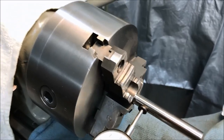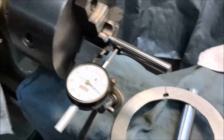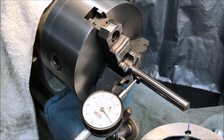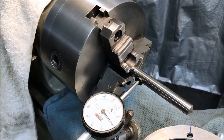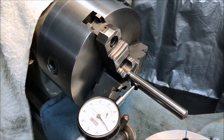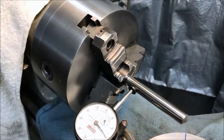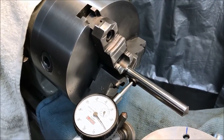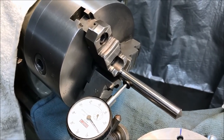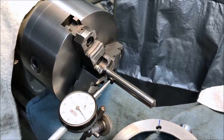Yeah, I did have originally this ring. I had the holes even smaller and it had less floating capability, and about halfway through the grind process I took some measurements and holy smokes, I was way off. So that's where I started enlarging these holes and paying more attention to how much preload I had on the jaws and so forth. So anyways, yeah, a couple steps backwards and we'll do some more grinding and hopefully we can get that last couple thou out of there.